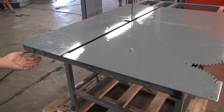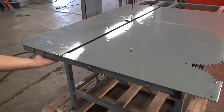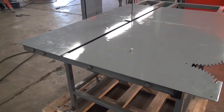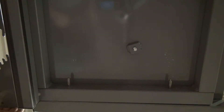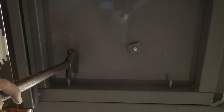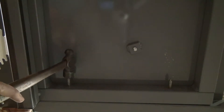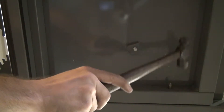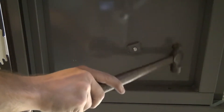To get these pins out, we'll simply tap them from underneath with a light hammer, and they should come right out. The camera is now underneath the saw, looking up at the bottom of the table. You can see the pins that hold on the pin bar. We're just going to tap those out — there will be two more on the other side.